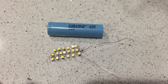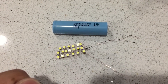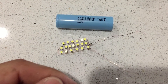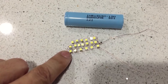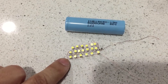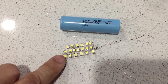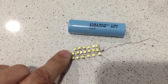Hello everybody, making a little video on how to solder up some LEDs. This is just a prototype, an experiment to see if these little LEDs survive the soldering process. I burnt up maybe two or three, so you got to be careful — do it quick, because if you don't, the plastic casing these LEDs are in will melt and totally mess up the housing.